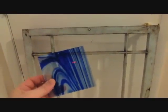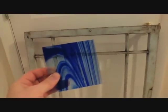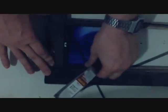I've laid the window down on the floor and this is the panel going into panel three. I want to make sure the swirls are straight up. If I just leave this in like this and hang it up, the window's going to fall out in about two seconds. So I'm going to take these glazier's points and use them to brace the panel. I'm going to take my putty knife and work them into the wood, wiggling them gently until they're flush with the panel.